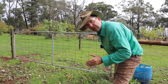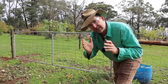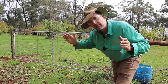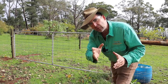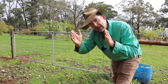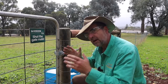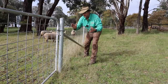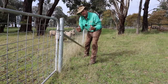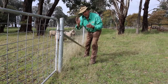If you measure a 12-foot gate, you'll find it's only 11 foot 10 inches long, because a couple of inches is left for the gate hardware that hangs them off the post — they're called a 12-foot gate because they fit a 12-foot gap. You've got two options for hanging your gate: on the end of the end post, in line with the run, which is perfect for vehicle access in both directions; or a side-mounted gate, which allows you to open the gate up against the fence and prevents stock from becoming jammed between the gate and the fence, lowering the risk of injuries. The side-mounted option requires a smaller gap than an end-mounted gate.